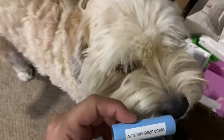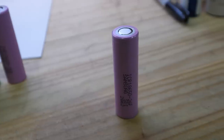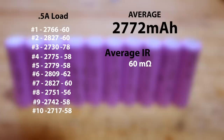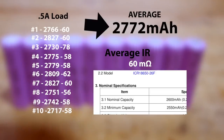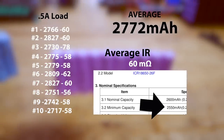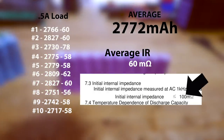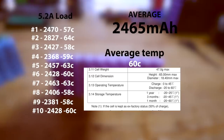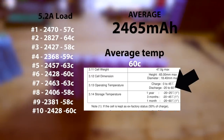This shows that our simple tests are very effective at picking up any anomalies. Up next is the Samsung ICR18650-26F cell. At an average capacity of 2,772 mAh, it clearly meets the minimum capacity of 2,550 mAh. The internal resistance also looks good. On the top end, the capacity looks good and the temperature is dead on. This is another genuine cell.